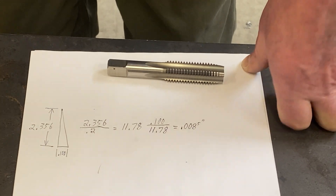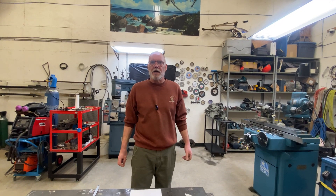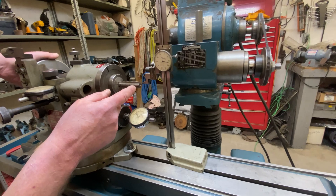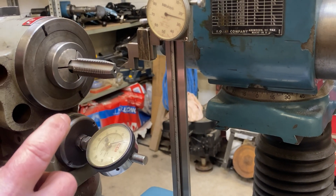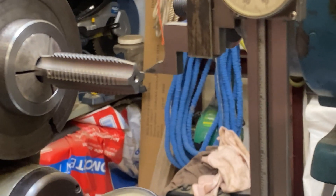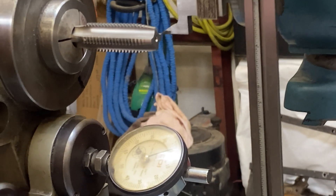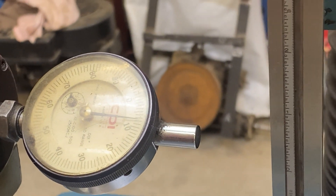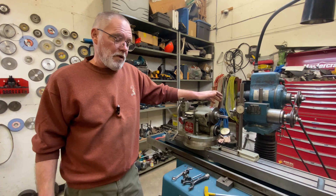So what does all that mean? Well, if you're the guy actually setting this thing up to grind it, it's a lot easier to demonstrate over at the machine. I've got my height gauge set here — that's just to use as a pointer. What I'm going to want to do is rotate my tap from one edge to the other edge of this height gauge, which represents my 200 thou — the width of my teeth. I know that I want this thing to travel 0.008 of an inch over that distance. Down here we have my axial travel dial, and as I rotate this from the start of the tooth to the back of the tooth you'll see we're getting 8 thou relief on this dial. Basically, as near as I can tell, the only real purpose of that is to perfectly align the grain of the grind with the pitch of the tap.